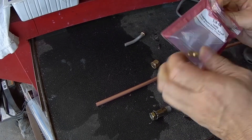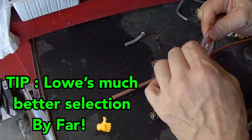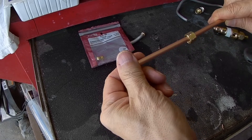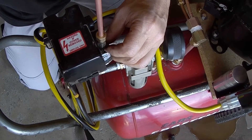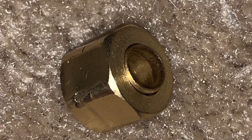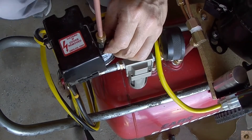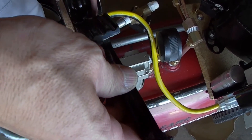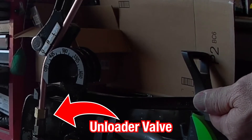Quick tip for compression fittings — Lowe's has a much larger selection. At Lowe's, I actually found these brass bushings that they sell a la carte, and I wasn't planning on using them, but I bought them anyway because I figured I could return them. Instead, I actually bought a brand new compression nut fitting and was going to use that with the old fitting I had. But it didn't want to match up well. So I decided to cut the old nut off and reuse it with the brand new bushing.